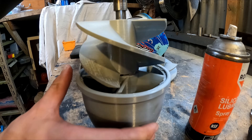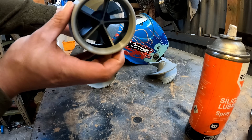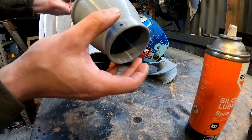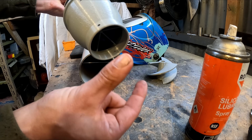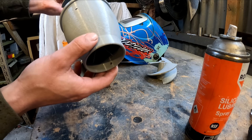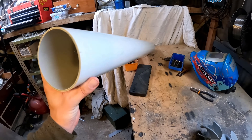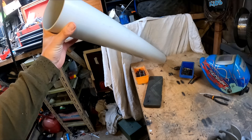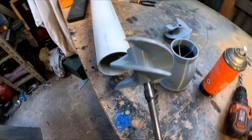As the water gets pushed off, it gets hooked by the flow corrector, straightened out, and shot out the back. I've made a step here so I can tap these and put removable nozzles in to reduce the size down and get optimum performance. For the outer sleeve I simply just got a piece of PVC pipe — it's cheap, a metre of this was like $14 or something, and I can just cut as many pieces off as I want.